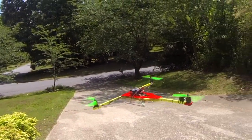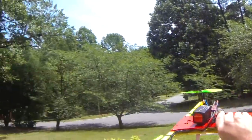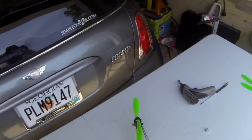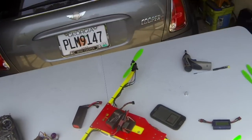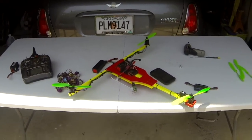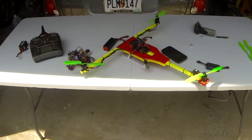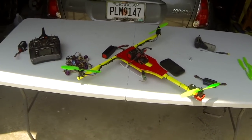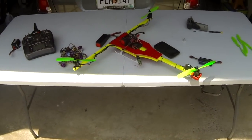There would have been a buzzing sound and I wouldn't suggest it. In general, if you're just going to learn and you're not going to go crazy and you want to save 30 bucks, then go ahead and buy the cheaper motors. On a simple wood copter frame, they're going to handle the vibration better than a carbon fiber type frame. If it had a carbon fiber or fiberglass frame, it might be a bad idea.